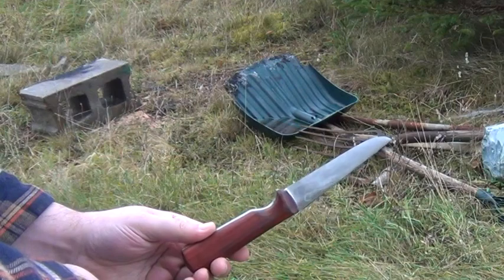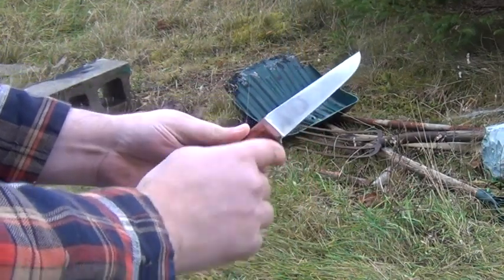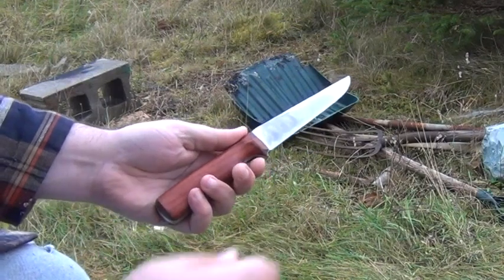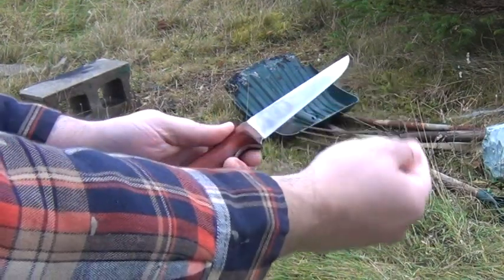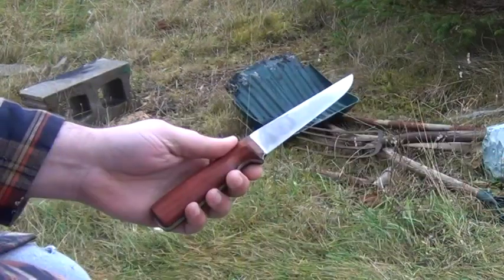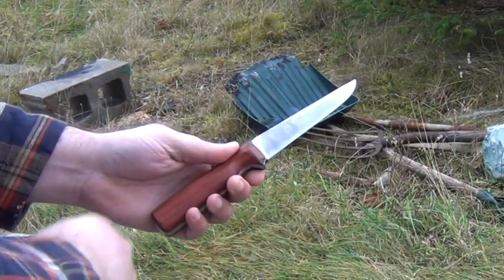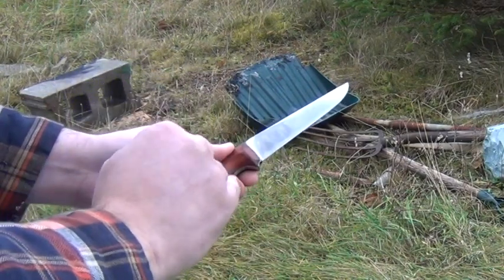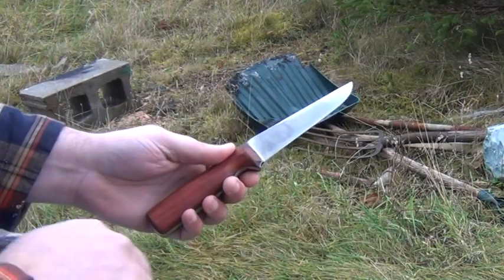This is a knife from Kali Harris in his testing steel, which still hasn't been revealed yet. Much thicker stock, but also a continuous grind. Because the stock is much, much thicker with blades of similar width, the angle is increased much more. So down by the edge, if this was zeroed from spine to edge, the edge would be somewhere around 9 to 11 degrees per side. But if you add on 4 to 5 degrees because of those little humps and hollows in the stone, now all of a sudden you have an edge that could be 15, 16, maybe even 17 degrees per side. I don't sharpen axes at 17 degrees per side generally. Those little humps and hollows will produce an increase in curvature at the very edge, and you can't control that because it's just random from the amount of wear in the stone.